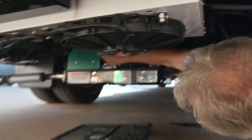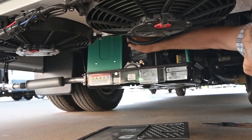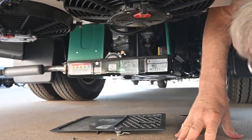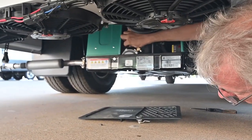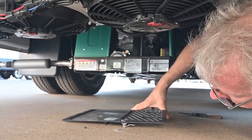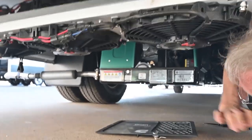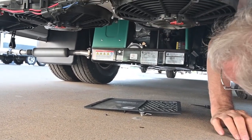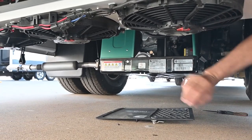I want to check that before my trip before I run the generator. The oil level is in between the marks right there - we've got fresh oil in this. When you get to 20 hours on the hour meter inside, you need to do the first engine service - that's the break-in period. After the break-in you can go much further, usually 150 to 250 hours between oil changes. That first one is critical because this is a new engine; you want to break it in properly. Always run it with a good load on it like the air conditioning - that'll break in and seat the rings and get it properly operating.